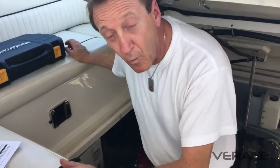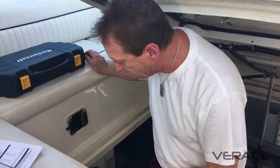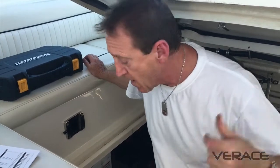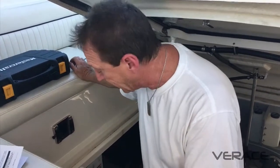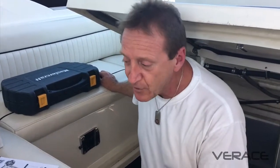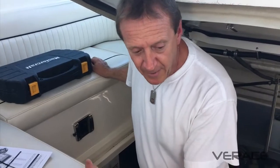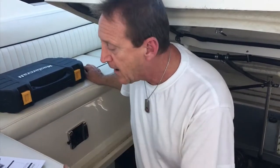It took a grand total of about one hour. Remember, you're working with AC and live DC because the batteries are always connected unless you disconnect them all. Be careful, don't drop anything, don't short-circuit anything on AC, make sure you're unhooked from shore, and turn off the breaker just to be doubly sure — it's good habit. Job done, saved a few hundred bucks. If you're not sure, get a qualified electrician. I've been playing with electronics and electricity for 35 years, but if you're not sure, don't take a chance — get an electrician or ask the marina, but it is a fairly straightforward job. You are playing with high voltage and high current.